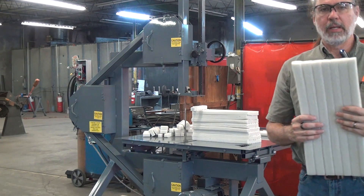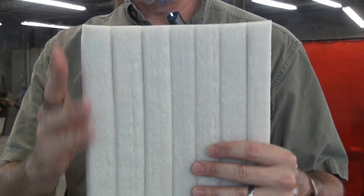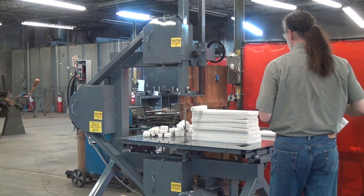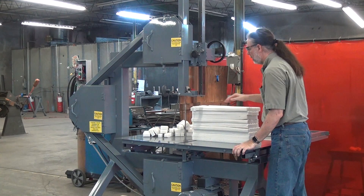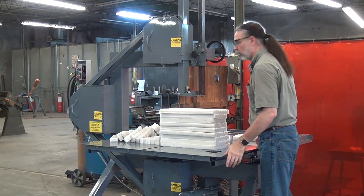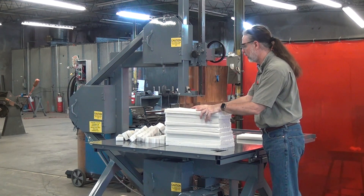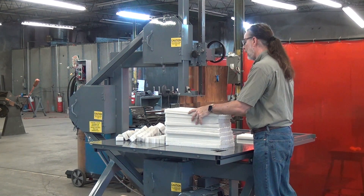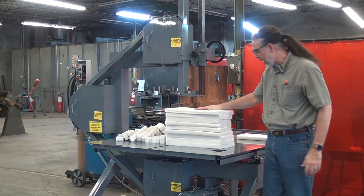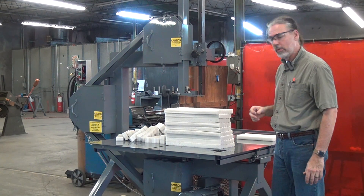Still a little bit of it. So I think my limiting factor here — I can get a perfectly straight cut — the limiting factor is that the material moves as I'm cutting it. The table's tracking straight. What's happening, I believe, is that I'm pushing in and this whole stack of workpieces is kind of bowing over a little bit or skewing as I hit the blade. So cutting a giant stack might just be too unstable with this material, but cutting three, four, five pieces probably works fine. We'll test the theory.